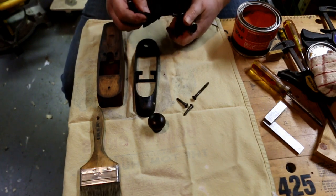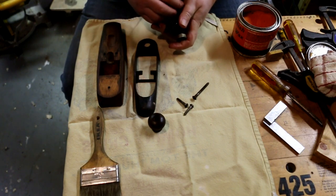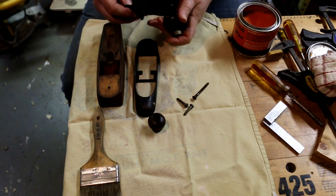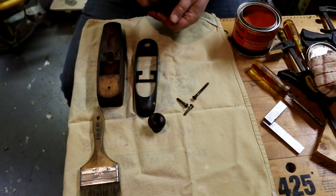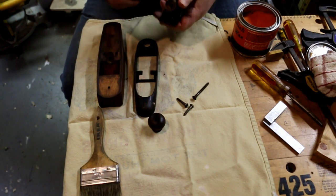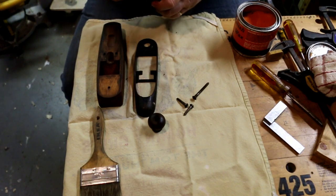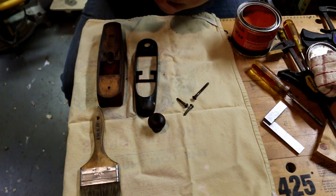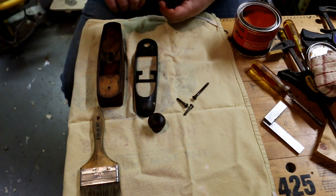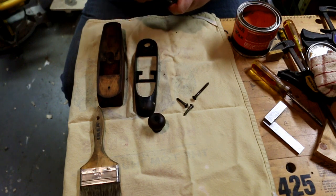So I put oil on it and that worked, but it didn't work really well. You had to keep the oil put on it because the oil would evaporate. And like I said, I hit upon this Boston polish wax and put it on. And the table didn't rust. Matter of fact, everything I put it on didn't rust. So from then on, everything I worked on, I waxed. Because I wanted it to stay. I put a lot of work into making it work.